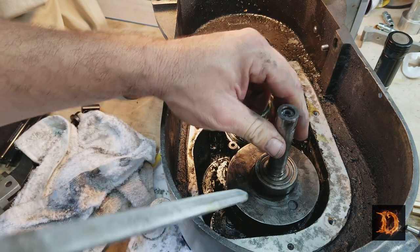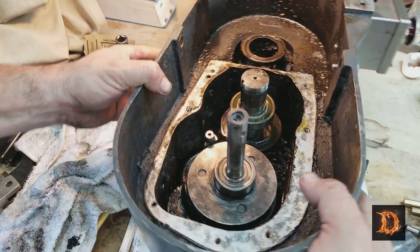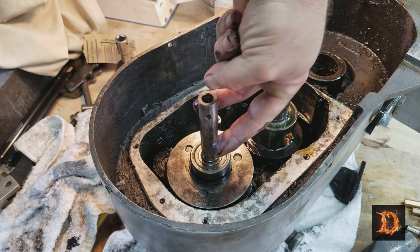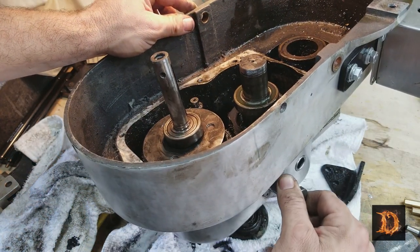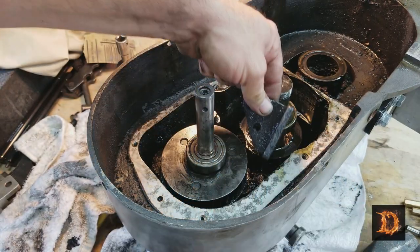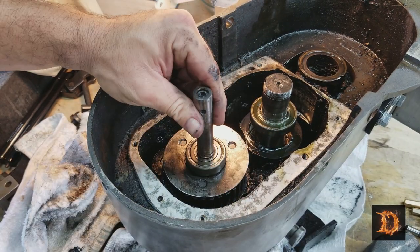Now we need to work on getting this out. Remember, we still have our belt under here. It was good to tap this up so the flat rollers are out of the way, so I can set the head up in this direction now. So I got to work on getting some things out of the way in here. There's some brass pieces. There's a finger yoke that sits in here on the clutch. That's part of your change lever over here, going from back gear to open pulley. So I got to get that loose down in there. This bracket was in here. The screws are over here. That comes out. That helps hold that yoke. So now we're going to work on getting this out as an assembly.